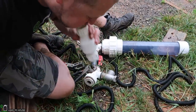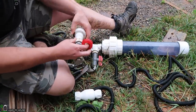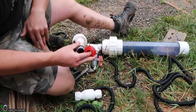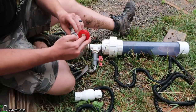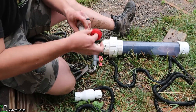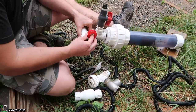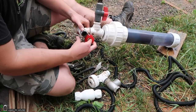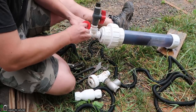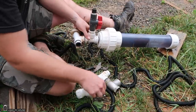With this new valve, I blow in there and nothing comes out, so it's a good one. That was our problem — I'm pretty much 100% sure. One thing that can help to avoid this kind of problem is to totally drain and remove your pump in the wintertime. I just let this thing sit for three years whenever I wasn't using it.